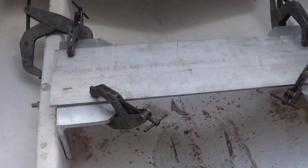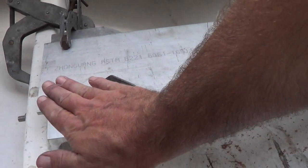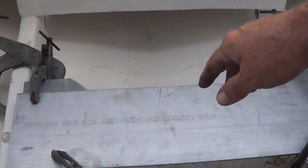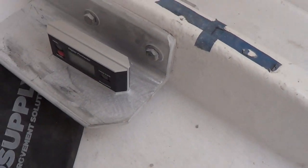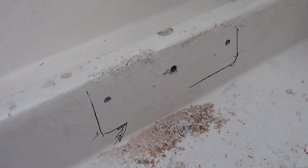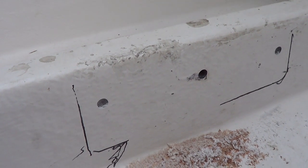Here's the setup: we've got two clamps on each side with a nice big wide piece of aluminum, which makes sure they're aligned on one plane - both laterally and tilt-wise. You can see I can loosen this one clamp right here and adjust the tilt to match the tilt on these guys. Then I go ahead and mark the holes with the drill - I just dimple them, because I'm going to drill them without the bracket in the way so I can make sure I'm drilling straight through.